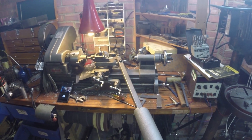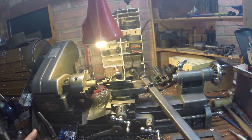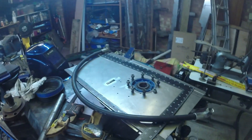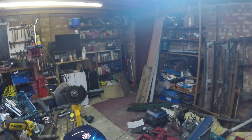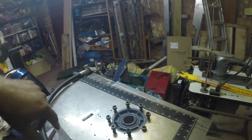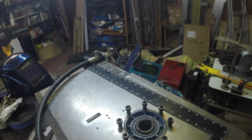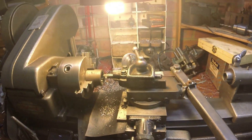The rest of the project I might put on YouTube — it's basically a hydraulic capstan winch for my Land Rover. I've got some footage of cutting the hole in this with a plasma cutter; there's a little wooden jig that the plasma cutter gets cable-tied into and you spin the work around underneath like a record player and it cuts a nice circle. I'm only just learning about YouTube — this is one of my first videos, so thanks for watching.